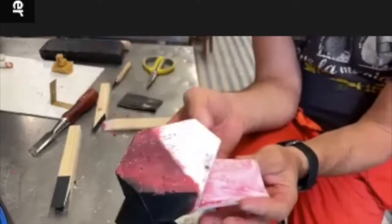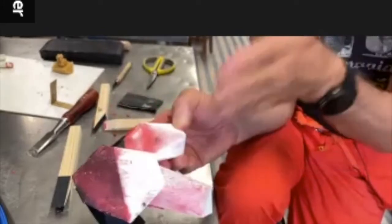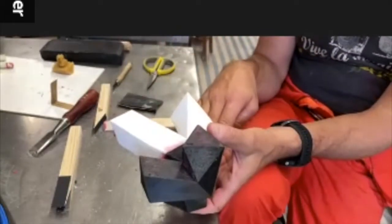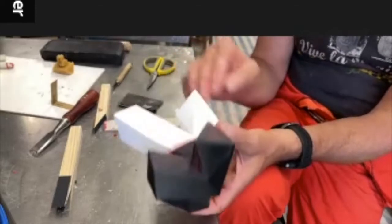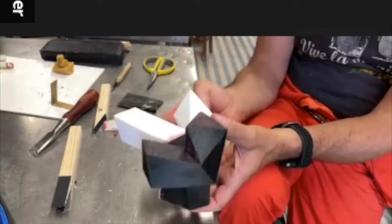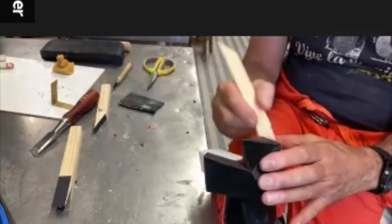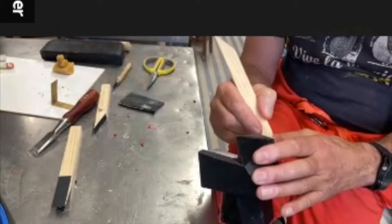Sometimes when you have a 3D print, you get a situation where the print is kind of open. I think it was printed like this. It's the underhangs that are usually pretty bad, where they start basically from the grid structure, from the support, where the slice itself provides a support structure and has to start printing into fairly thin air.